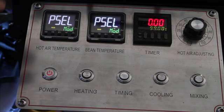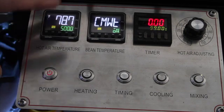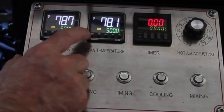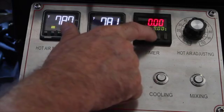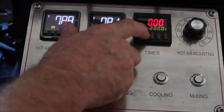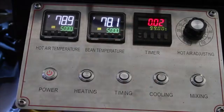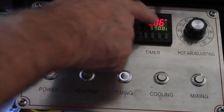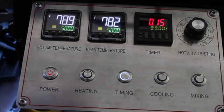If you follow all those settings, then you click back on the levels button for a second, you're going to bring everything back to the way it should be set. Let me just remind you the timer reset button is right there. If you accidentally hit one of these buttons, you may cause the timer to be set so it only goes off for nine minutes if it was set at 99. If it happened to be set at just 90 and you accidentally hit that button, your timer will no longer work. So we ask you in general to set at least 99 — that way if you see your timer stopped working, you'll know you accidentally hit one of these buttons. This timer is designed to go off after 99 minutes, which you'll never have to worry about — a roast going 99 minutes means you're in serious trouble.